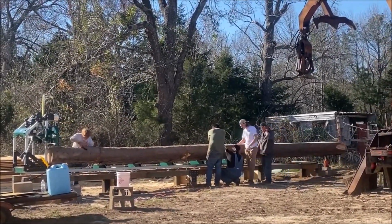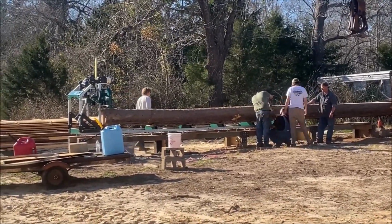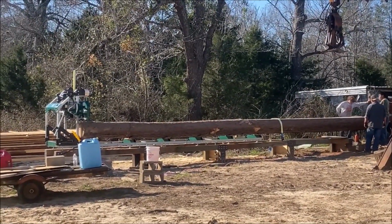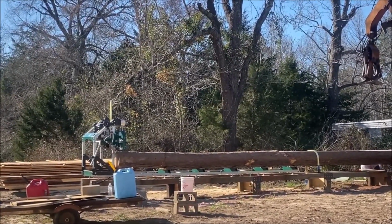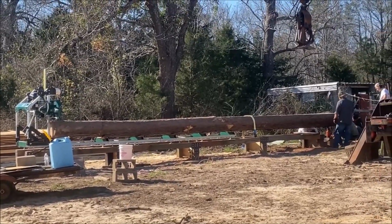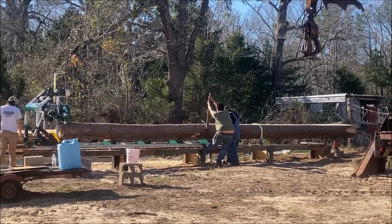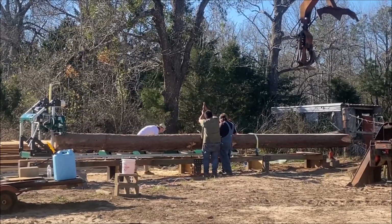That water level, I never knew how handy a water level was until I actually built one and started using it. I mean, you can use it for anything. You get that water at the level you want it, and you just measure off of your bubble, so it don't matter how far out you go. Right there I got 50 foot on it, but I got a splice in the middle, and I got another 50-foot hose I can put on it. So, it does a real good job.